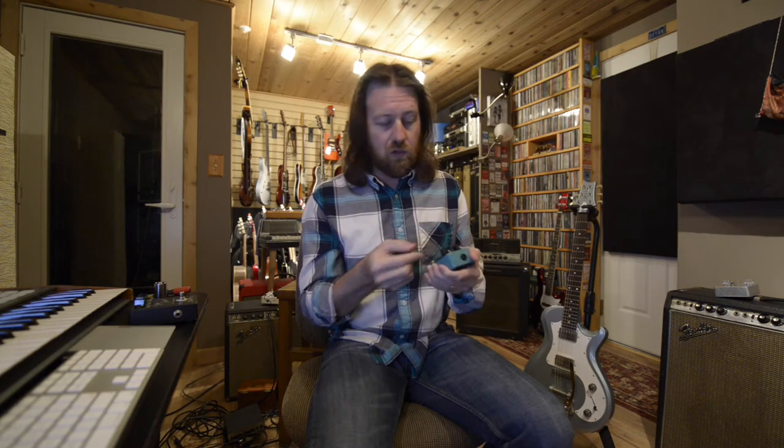The new Tone Press has a few little toggles that I'll talk about in a second, which give you more control over a few of the speed settings and kind of an EQ curve. But basically, when you crank up the sustain, that's the amount of compression. That really is adjusting the threshold, and the ratio kind of varies depending on what the setting is.